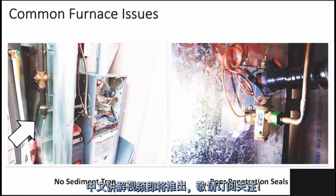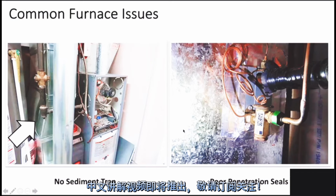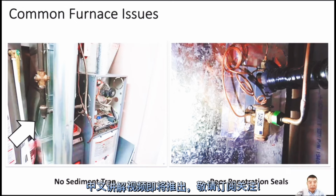So I see that there probably is a fresh air intake here for both the hot water tank and the furnace. But once you put the cover on the front of that furnace, it's basically half starved for air. Yeah, so I understand. I think we should have some slides. We will talk later. So that's very important. In fact, some guys just block this pipe too. So let's see that later.